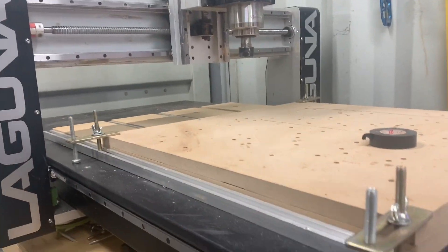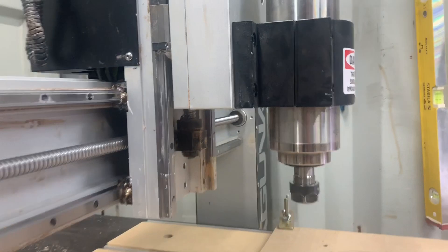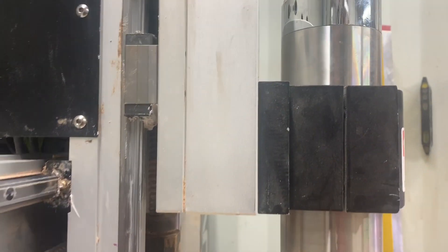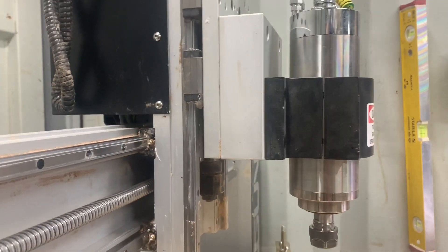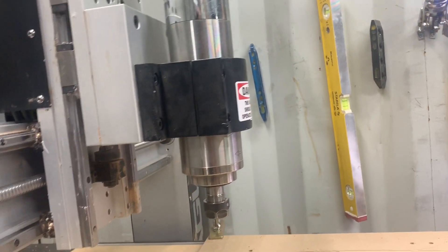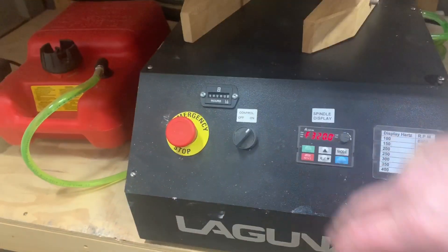I've got all the rails cleaned and a little grease on them. These nipples up under here are hard to get with that needle fitting — if mine were longer it'd be easier, but it's tough. I got a little bit of grease in each one of them and all my ball screws got a little lube on them. The one up under here is pretty tough — you've got to get your arm up in there to get a little bit of grease on it. Next thing, I'm going to pull the cover off.